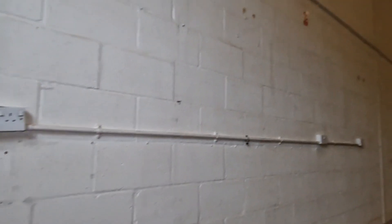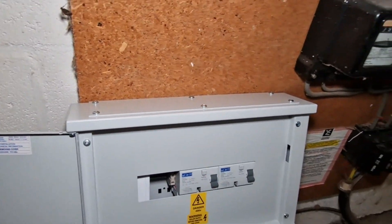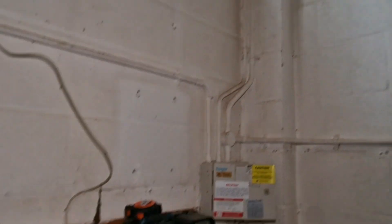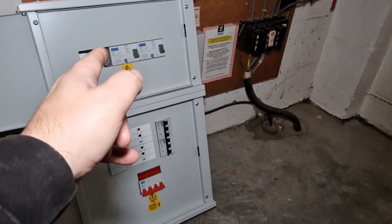Where I am right now, these sockets are coming off this wall as we're putting our office building up here so they're no longer needed. We've got the existing pipes dropping down the wall which I'm hoping to work into the DB — it does have a gland plate on the top. I may end up popping some trunking up and around it just to make it a little bit easier to get these existing tubes dressed away. We'll see how that comes together once I've got this on the wall.